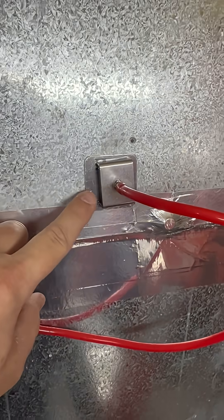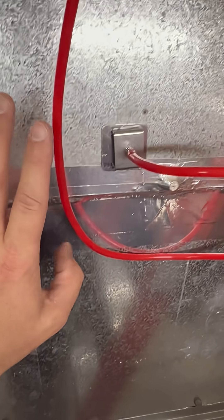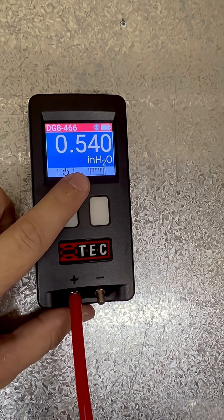The magnet sticks to it. In a system like this, we've got our open return down there — the main way it's getting air is through this grill on the wall. This is a huge commercial unit; there are coils all through here, basically a fan coil. I'm measuring here at the beginning of the supply plenum and I can see I've got about 0.54 inches of static pressure.